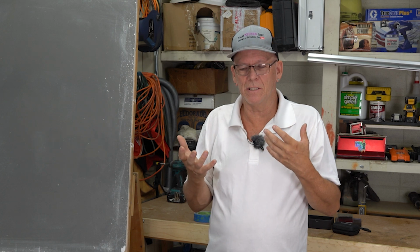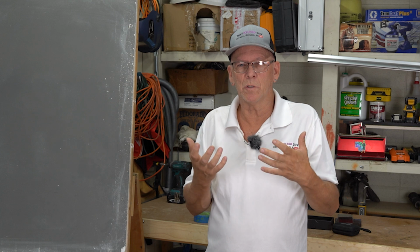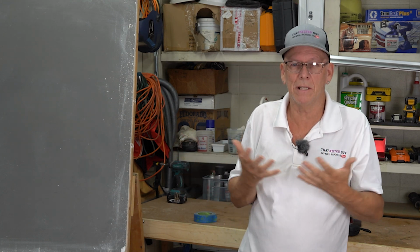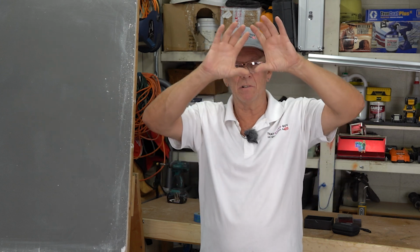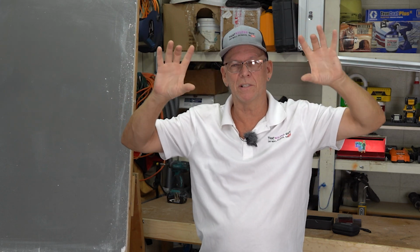Now you're going to see usually a lot coming out of the glass, but it'll tell you if you got any cold spots, like maybe you missed some insulation, or they did when they built it, or maybe a remodel happened and it didn't get re-insulated. You'll often see the headers. Headers are usually solid wood. They'll be colder. You can see that thermal bridging happening.